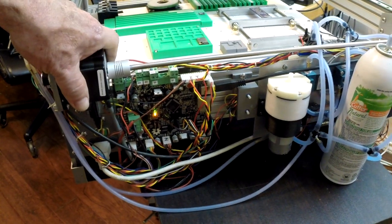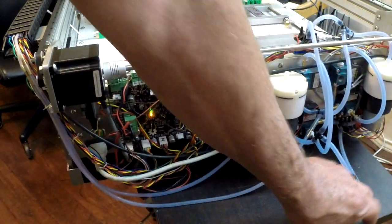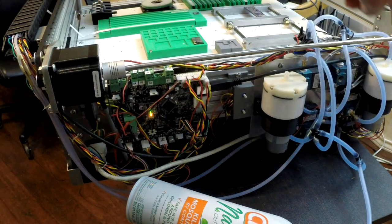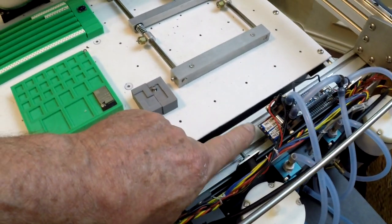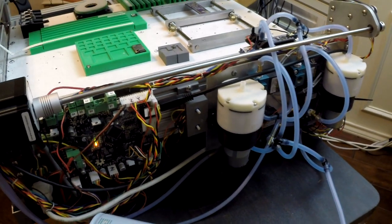The Smoothie board, you can see over here, is just the hodgepodge of all the valves and stuff that you have to wire all up, as clumsy as I am. But there's a couple little extra things here I did. I made a regulator board so that the pumps come on, bring it up to pressure and vacuum, and then they shut off. And there's levels. I have a couple of pots here, which I can set the levels on as to what the maximum and the minimum pressure is on pressure and vacuum levels.